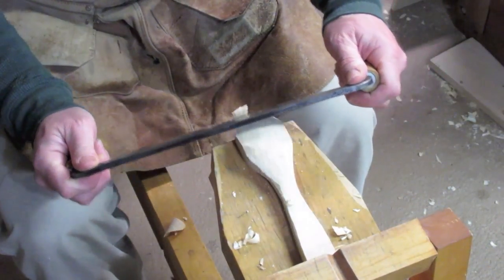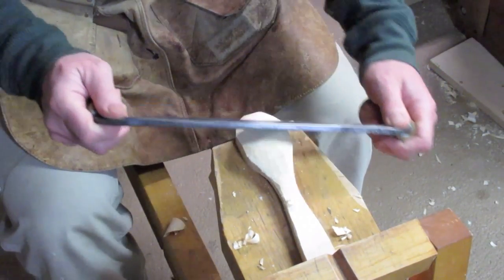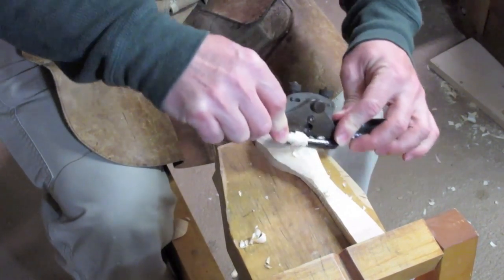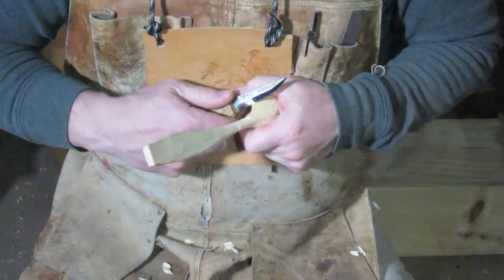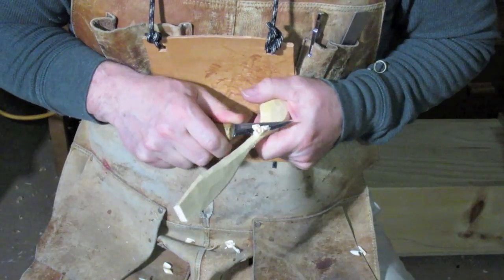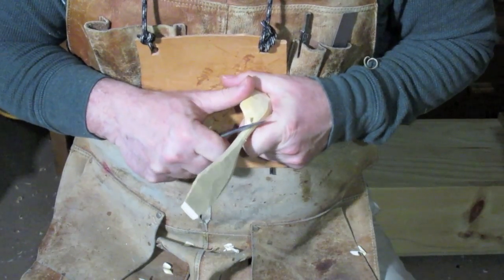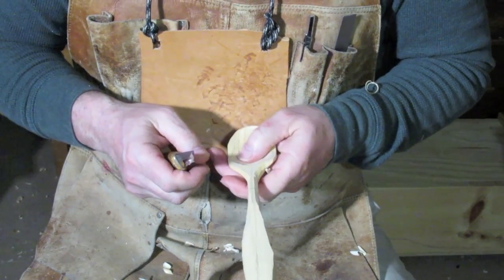With the bowl roughly hollowed, work the outside surfaces. If you have a draw knife or a spoke shave or some good rasps, this is the time to use them. The traditional tool to bring the outside of the spoon to its final shape is a sloyd knife, and Highland Woodworking has several good ones you might consider. Whatever tools you use, shape the outside of the bowl and then thin and shape the handle.